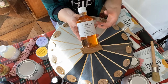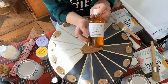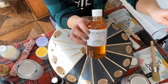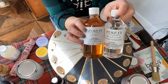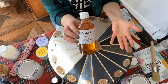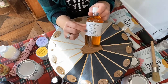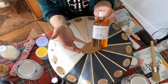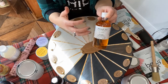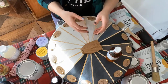We highly recommend sealing exterior milk painted pieces with our Fusion tung oil — it's an amazing top coat for milk painted exterior pieces. You can thin the tung oil with Fusion odorless solvent. The only exception is if you paint a bright white — if you use tung oil, you're going to see a little bit of ambering and yellowing effect over that bright white surface.